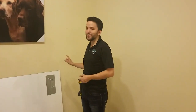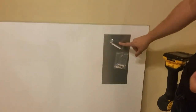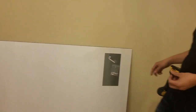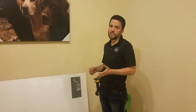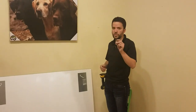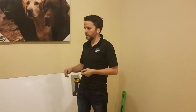We're going to show you how to hang a tempered glass piece — this is a 40 by 60 from Classy Art with the sawtooth hooks in an angle. This is a horizontal piece. It comes with the hanging hardware, which is two screws and an anchor for the retail customer to purchase for their home. If you want to hang it in your store, just use sheetrock screws — this is a two-inch sheetrock screw you can get at any hardware store.